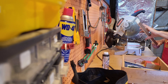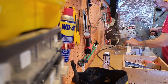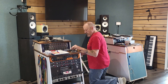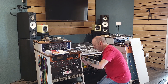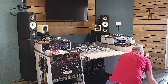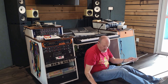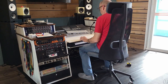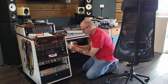I cut the second board — these pieces are holding up the center shelf and had to be cut to the right length since the center shelf is shorter. I used the other two pieces to hold up the computer keyboard shelf. I put the middle shelf back where it used to be using the ledger boards I'd cut, then figured out the right height for the computer keyboard shelf. I measured the height of the MIDI keyboard — about four inches — got the shelf rails, connected and leveled them, then tested and found it was too low and banging my knees because I hadn't pre-planned the height.